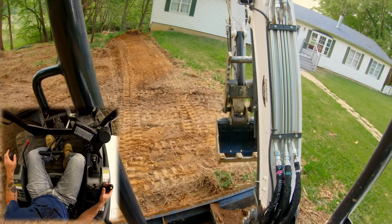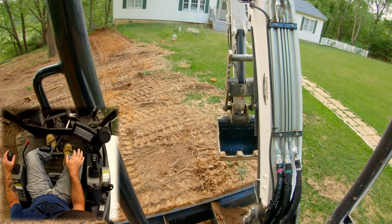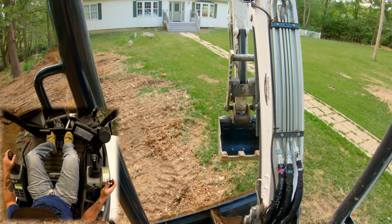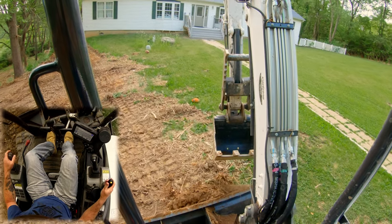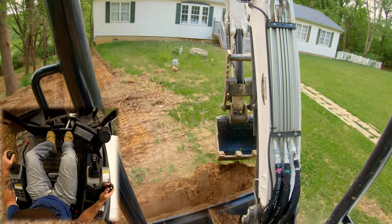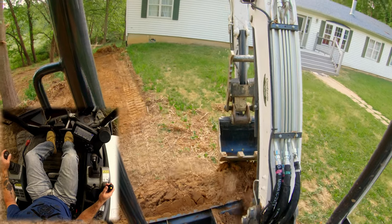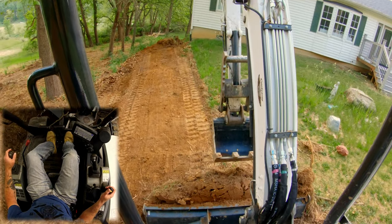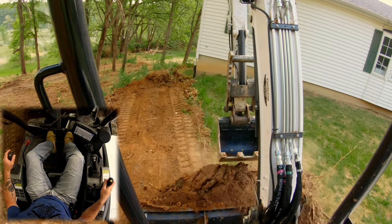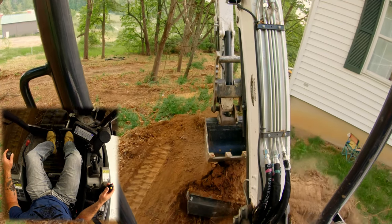We're going to come all the way back here because I kind of went around this whole slope. We'll set our blade — I'm basically straddling my new slope and the existing slope — and we're going to take the ridge out of the middle. We're not going to be super aggressive, just kind of round off the top of this ridge. As we approach the house, don't get so caught up looking down that you aren't paying attention to your boom and accidentally cause damage.